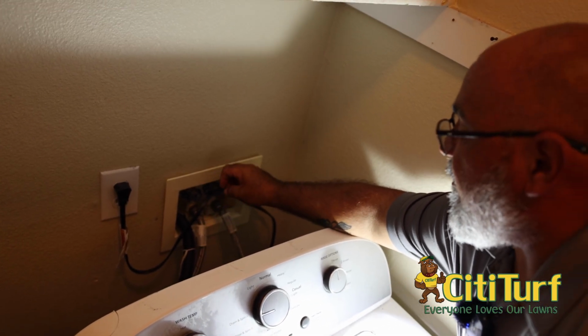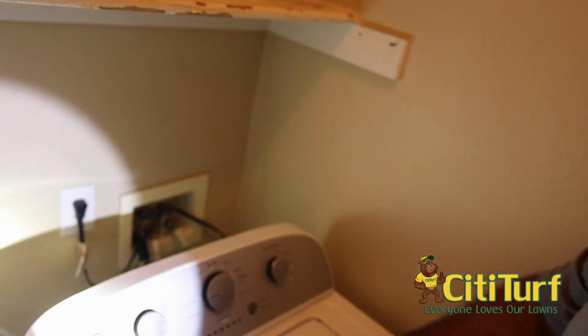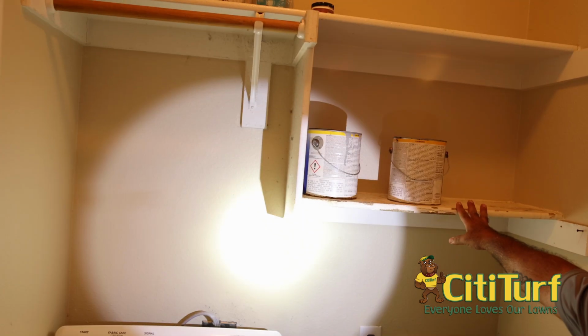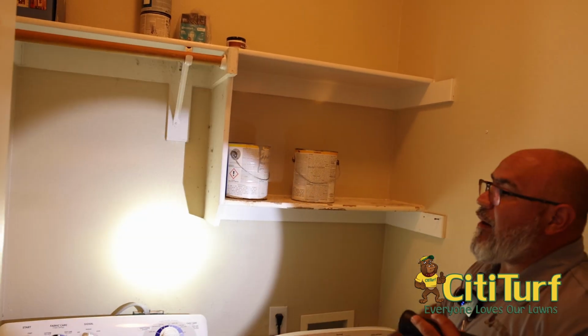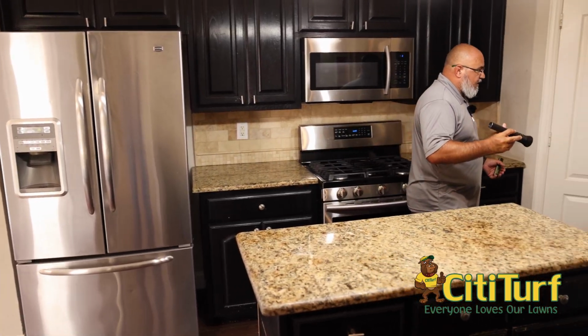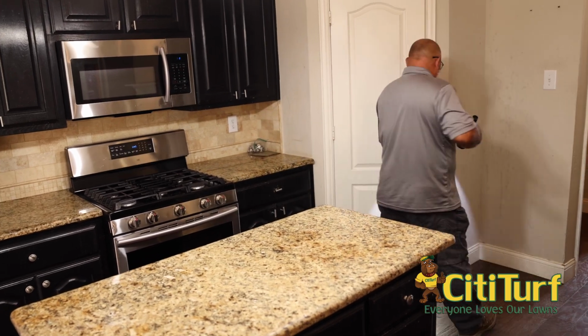These plumbing penetrations go down into the concrete and then actually come up right here. That looks fine there. Don't see any issues. This here is just all water damage, just old, and it's not termite related or anything like that. So things like that we look for, and you're looking at the walls and looking up, and make sure you're always checking the pantry.